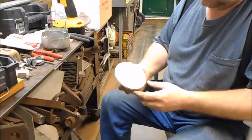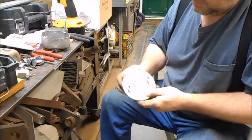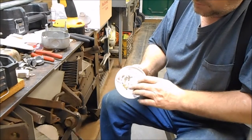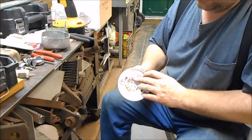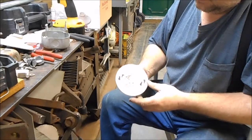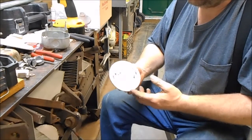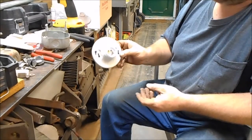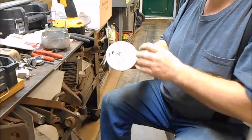When you're wiring up these little things, it's pretty much common sense. You don't have to call an electrician to wire up one of these little boxes. You have a white wire and a black wire. You've got a silver terminal and a gold-colored terminal — you want your black on the gold and your white on the silver. Wire up your grounds too. It's not a big deal wiring up these lights for your garage or basement. Just make sure black's on gold and white is on silver and you'll be fine.